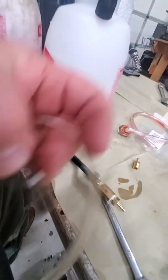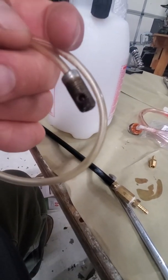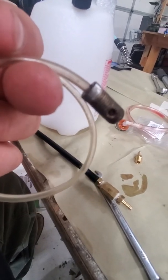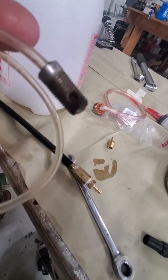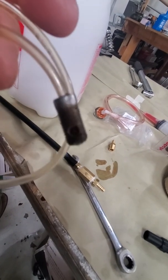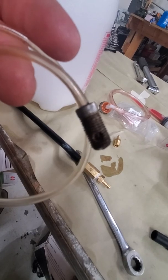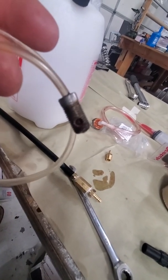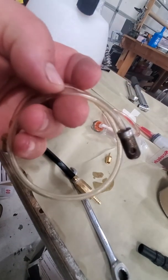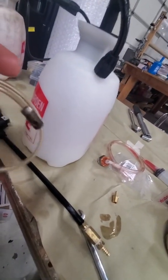This adapter is made from the end of a bolt — an AN6 bolt — that I drilled all the way through to where the cotter pin goes. This fits into a Scott master cylinder, like the Piper Super Cub, J-3, PA-12, or other aircraft with Scott heel brakes. Screw it in, attach your collection cup, and you can bleed all the air out without making a mess, recovering the fluid in a paint cup or water bottle.